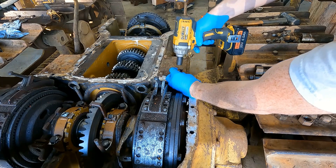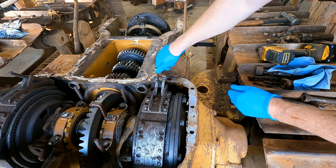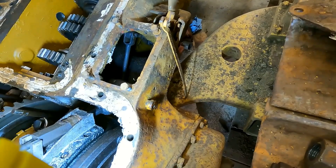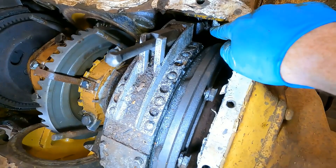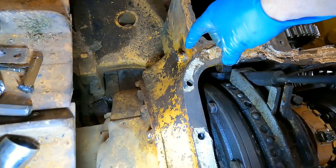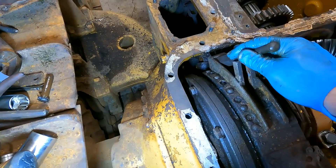Let's see what's in here. These do not look like factory covers — they're completely pitted and rusted. This must be the rest of the brake bracketry. Okay, here's the deal — if the manual says you've got to pull this bar out here, this connects all the brake linkage. But I'm pretty sure I can just remove this pin right here, that's connected to one side of the brake band, and then remove the pin over here, and then I should be able to just pull the whole thing out without having to take this bar out. I already got the pin disconnected there, and over here so this is all free now, so it should just pull right out — I guess we'll find out.